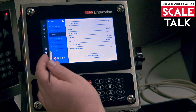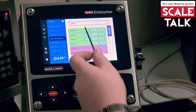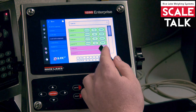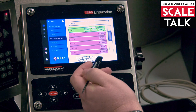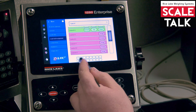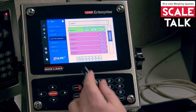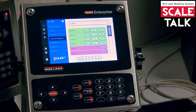I'm going to leave it at 75k. Under load cell assignment, we can see that the four cells on the primary board are already assigned to scale one. If we had an eight-cell truck scale, you'd have to manually assign cells five through eight, and you can use the slider on the side to move down. On the bottom, you'll actually be building up your load cell layout on your truck scale on the graph. I'm going to leave it at four because I only have one board.